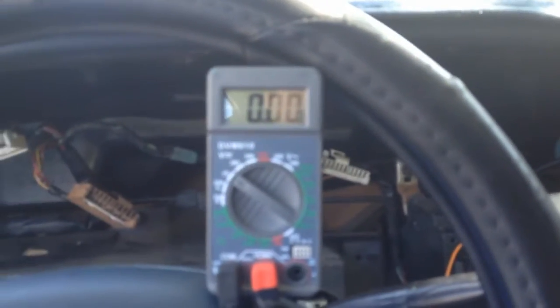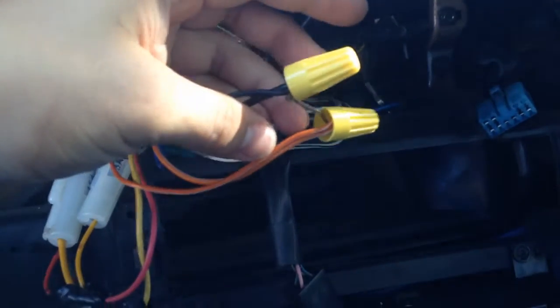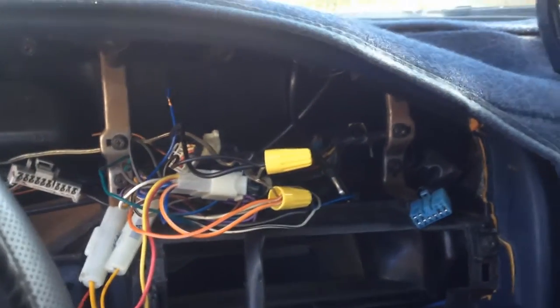Unfortunately I can't get that original cable working anymore and I've spent hours googling it, so we have a solution that will work. I'm just going to tap into it and run the wire back behind this post, back behind where the cluster is. There's plenty of room behind here, and then probably down through this hole where I'll have the Arduino. I've now spliced the ground and the orange and white wire — which is 12.6 volts when the headlights are on — and that wire goes down behind the normal wire harness through this hole and down to the floor.